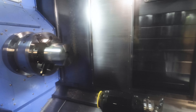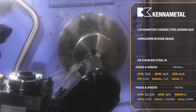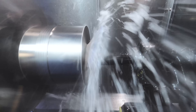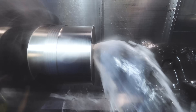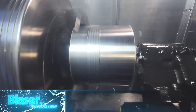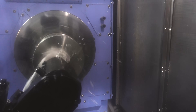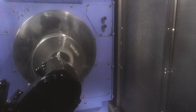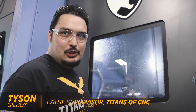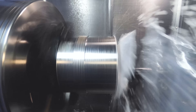We're taking it 10 thousandths away and then we're going to start the next tool. Right now we're roughing out the bore. For the OD of the part we went with 600 SFM. I dropped it down to 500 SFM on the ID because my boring bar is sticking out a little bit. I'm using a feed per revolution of 12 thousandths and I'm taking 130 thousandths for the depth of cut.